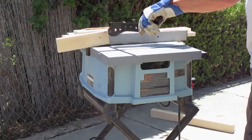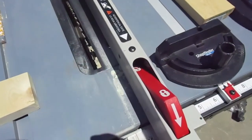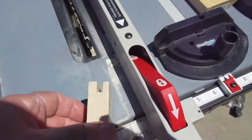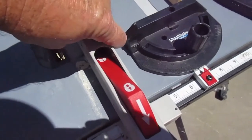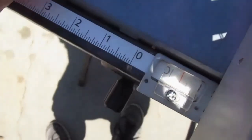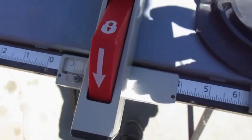If you're at a production level or a master carpenter doing this regularly, then you need a dado set. But I'm just a DIYer building a handful of cabinets for a kitchen, so I'm going to use existing table saw blades to make these notch cuts. That's when your table saw fence really comes in handy — you can set it, make your first notch cut, set it again, flip the piece of lumber around, and make your second or third notch cuts.